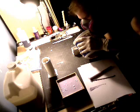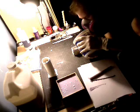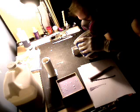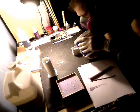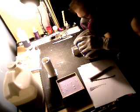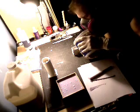This can be a very agonizing process. It's difficult to be patient when you really just want to fill the whole cavity. But it's necessary because you don't want to miss anything. You don't want to get any gaps in there. You want it to be nice and uniform. And the slower you pour, the fewer air bubbles get inside. Like, I poured that hat mold pretty fast, which is why there are probably going to be a considerable amount of air bubbles inside. But that's okay.